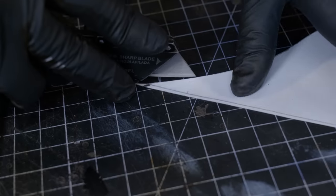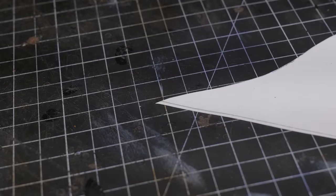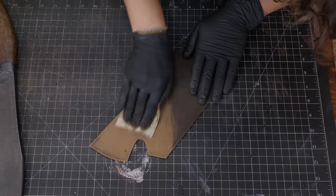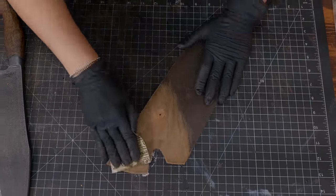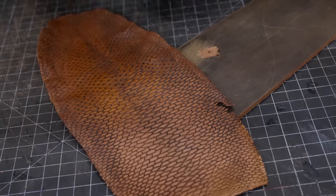We're going to round out this point just a little bit — right now it's very pointy. When we sand off this nice smooth top, it's going to open up the grain and it'll accept the glue a lot better. Then these will stick together just right.